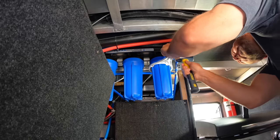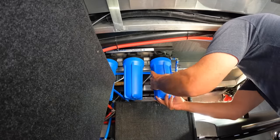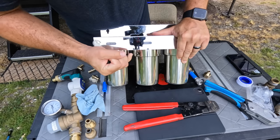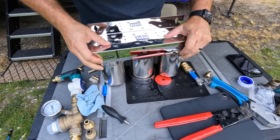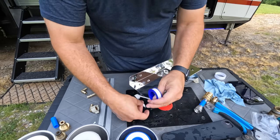Because this thing's full of water, I'm going to pull the filters off so I can mount the base without having to hold it up. I wanted to show how these attach and how they screw on. With the ClearSource or similar systems with big plastic housings, the entire bottom rotates and threads in, and they usually have a special wrench. This Blue Tech system has a little collar — you use the collar to loosen it, and just that collar unscrews and pops off so the filter comes out. Really convenient.